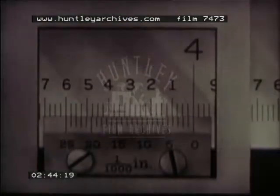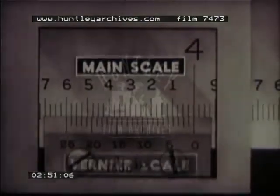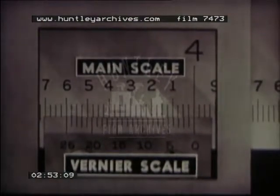The base of the vernier height gauge is ground and lapped on the bottom and also on the top, and its precise thickness dimension enables accurate measurements to be taken from either the top or bottom of the base. The vernier scale on the height gauge enables measurements to be made in steps of 1/1000th of an inch. The scale on the blade is called the main scale to distinguish it from the vernier scale on the movable jaw.